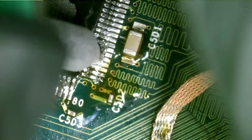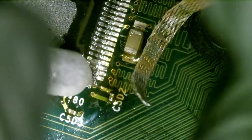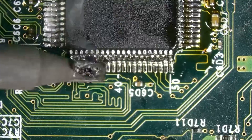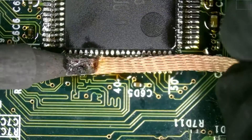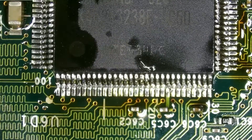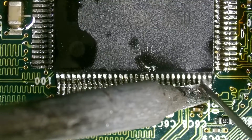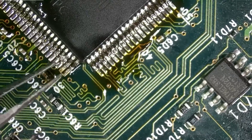That bridge just will not go away. Performing this mod reminds me of the NAND which I used to do for the 360s back before Executor came out with their Demon chip. Looks like we're good on this one, and this is where we have pin 28 that we'll need to lift. There's just no other way to do this. We need to lift pin 28 — counting 30, 29, 28 — third from last. I'd probably use fine tweezers for this part. You want to be gentle with this because bad stuff could happen at this portion of the install.